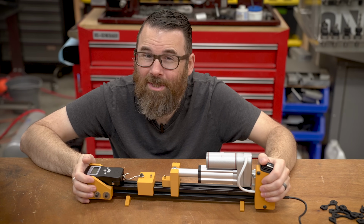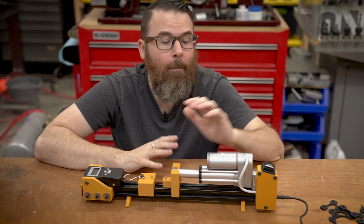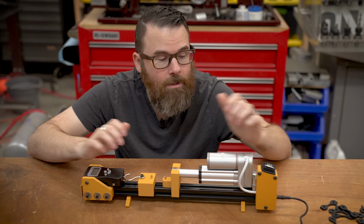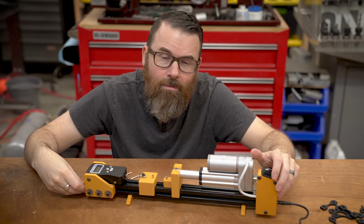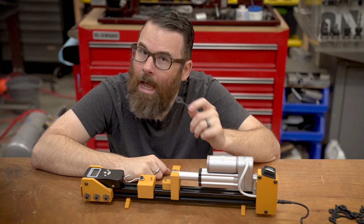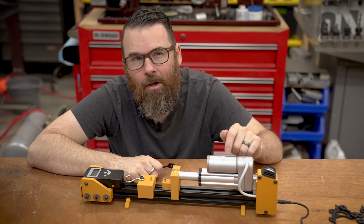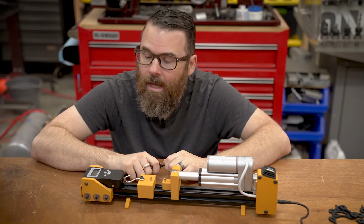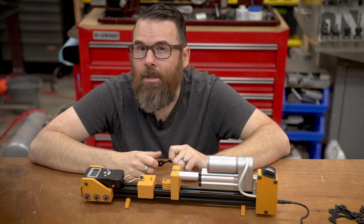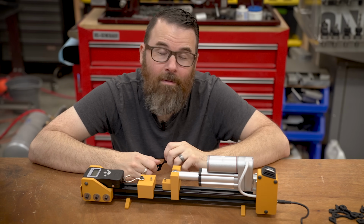This is by no means the nicest tensile tester out there, and it will kind of hit a wall in terms of scientific accuracy very quickly, but this is also something that you can download and build in an afternoon. It is really cheap and quick to build. So hopefully this will work out for what I'm trying to do, and if not, I'll make another one and update the design somehow. I need to kind of figure out a better way to size these because we're really not using the max potential of this. This supposedly can do about 200 pounds. My guess is probably only about 100, 150, and this tops out about 100, 110 pounds. So I need to kind of size these up a little bit, but different filaments are going to be different. So I'll probably have a lot of different sizes of these depending on the type of filament that you use.